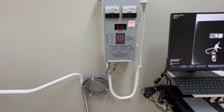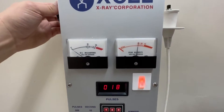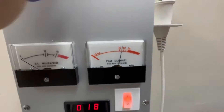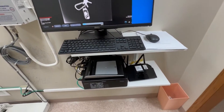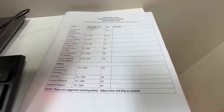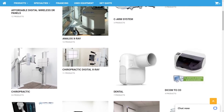Here's where you set the technique — you change the pulses or the time here. Here's the chart for the time. Then you move this dial to change the KV, just like that. Then you take the exposure with the button. The image will come up on here very fast, within about six seconds. It even comes with a little chart to do the proper exposures. Thank you for watching this video.